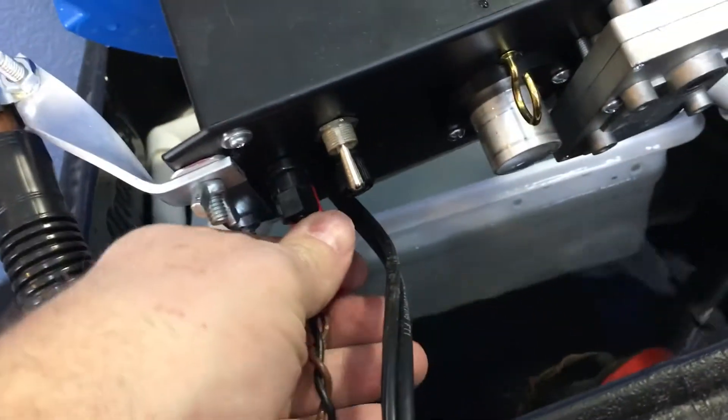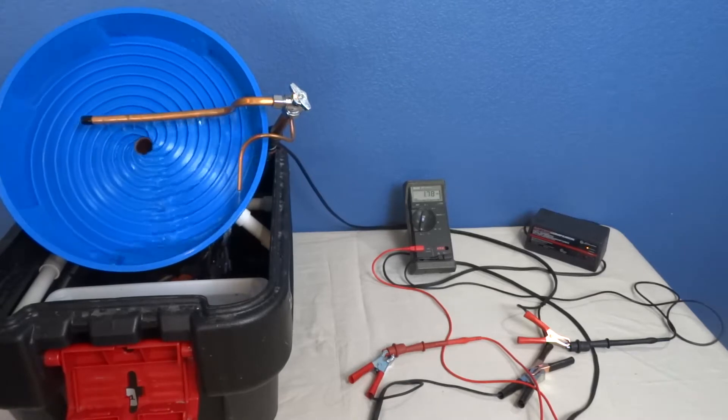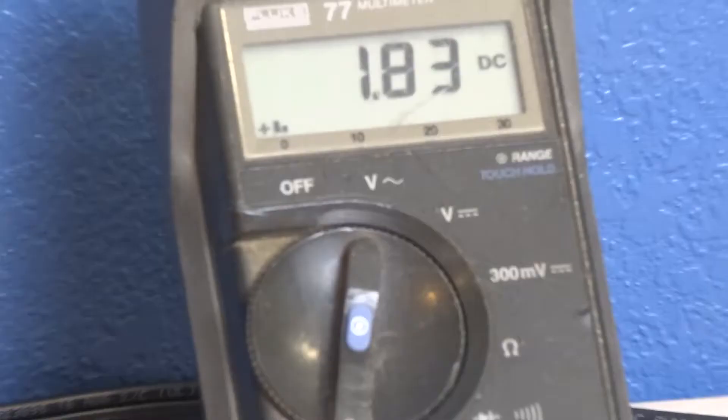Here's how this thing works: there's an on/off switch and a wire that feeds the pump in the bottom — that's just on banana plugs so you can take it loose. The bucket hangs on a little brass hook. The problem is it's made to plug into your battery clamps on your car to prospect in the field. I've got it hooked to a battery charger, which isn't super safe, so I'm checking the current draw — looks like it's drawing about 1.8 amps between the motor and the pump.